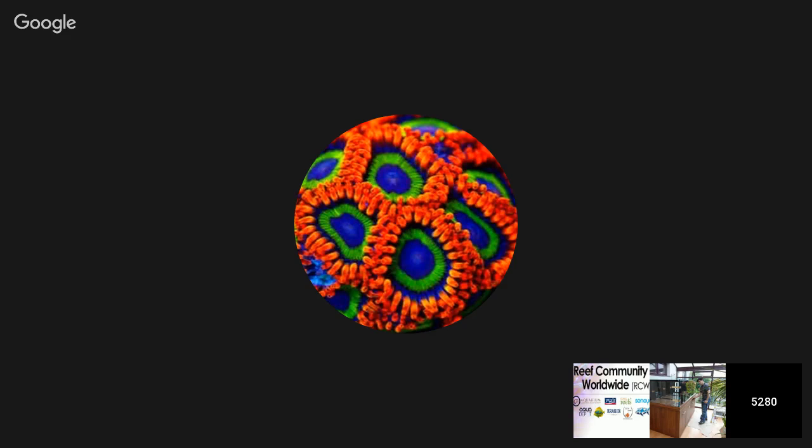And that's going to be very, very difficult for LEDs to beat because of how the light source is produced. The diode is set on a flat surface and the light goes straight down, and a little bit off of the sides based off of how much degree the diode has, how circular it is, how flat it is on the back part of it, which is mounted to a flat heat sink, compared to a metal halide or a T5, which is a sphere, a perfect tube, and the light bounces inside of that tube, and then it bounces in the outer layer glass of the metal halide and then comes out. So you've got a lot of spread and a lot of bounce already.